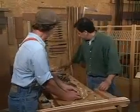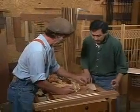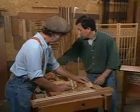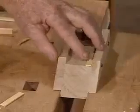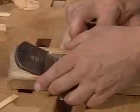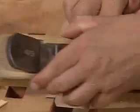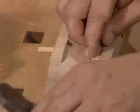You have, like you say, the plane itself is just a jig, so you just use another jig. Exactly, right. It's pretty simple. It's just a donkey's ear. And there's your piece. There's your long piece. My little long piece, right. This is going to hold the plane at an angle, so I'll create my miters this way, and then I flip the piece over and do it again. Uh-huh. So you've got the ends done.